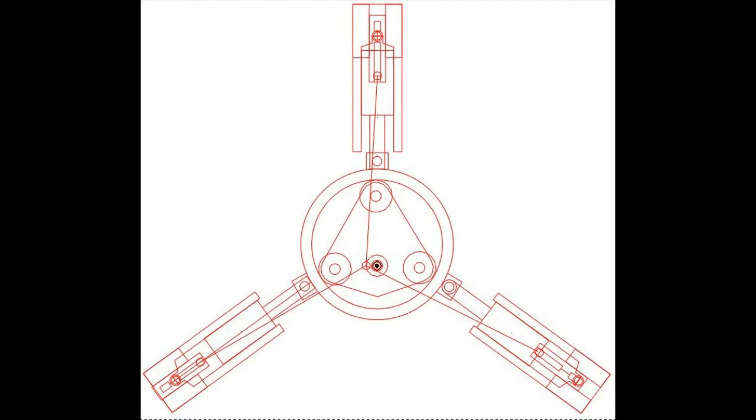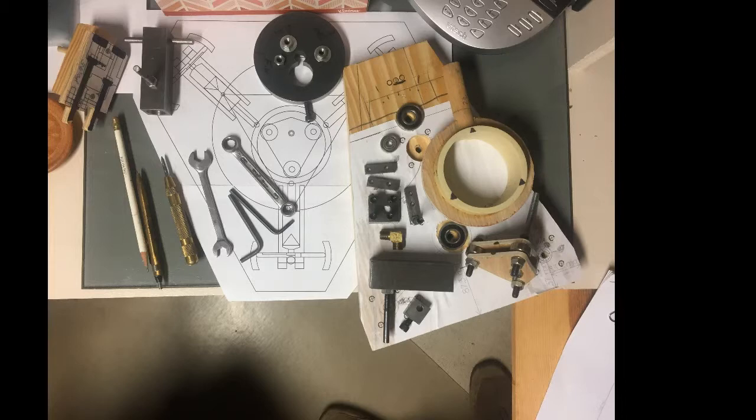Parts for the 3-cylinder engine. These are some of the parts that I made just the other day to show you what parts went into the first single engine. It's got the cylinder and a pivot pin. The 3 small pieces there are the valve, and that center section has the 3 bearings. Up on the upper center, there's a balance wheel that I'm going to use for helping it if it's run on 1 or 2 cylinders, because it won't start on 2 cylinders without being in a certain position. With 3 cylinders, it'll start in any position, so that eventually will be what I have.